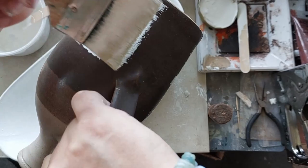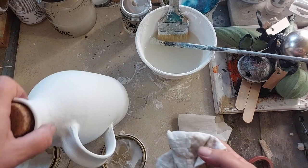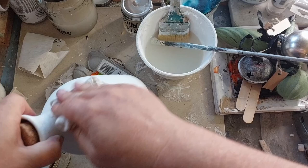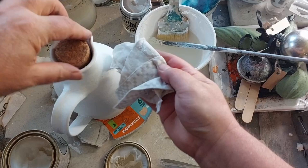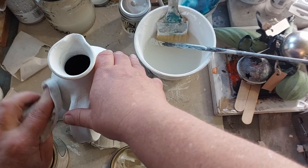My first little project is what I've called the little brown jug. I actually really like this and it has turned out fabulously. I've done maybe three or four coats of the chalk paint, wiped in some antique wax as a finish, and that's it. Simple as, and looks really effective. I also gave the cork a bit of a clean because it was pretty grubby. I forgot to add that I did sand it down between layers, so it has a beautiful smooth finish.